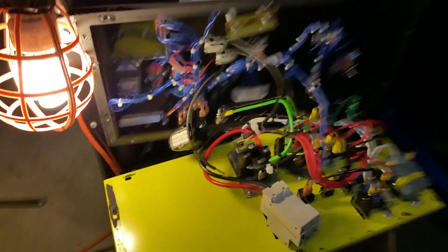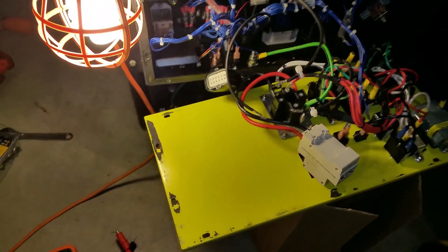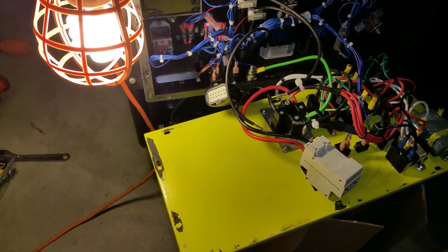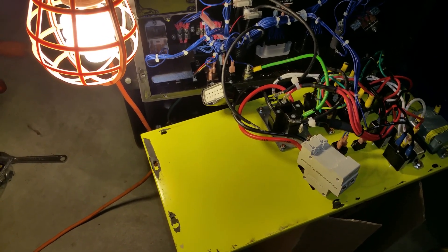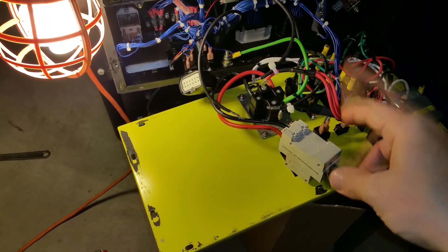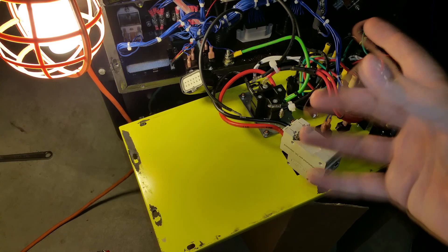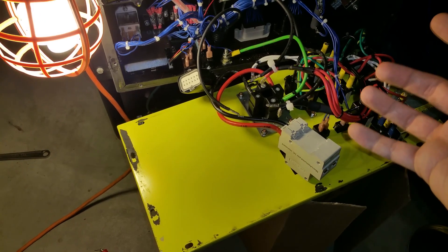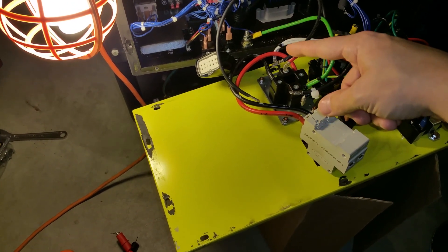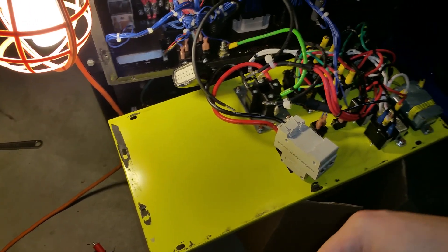I was able to obtain this machine for a very low cost. The gas engine actually runs perfectly — no issues at all — just the generator side seems to have problems. With the symptom of low voltage on one leg and really high voltage on the other, that tells me I have to look at the neutral lug. A loose neutral lug, depending on how it's loaded from each side of the phase, could cause an imbalance and build up high resistance.